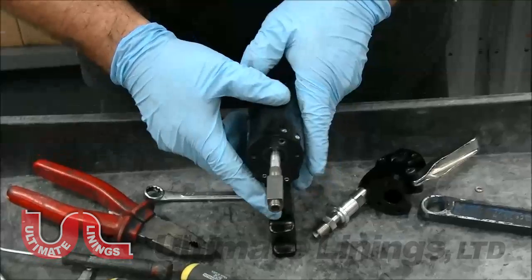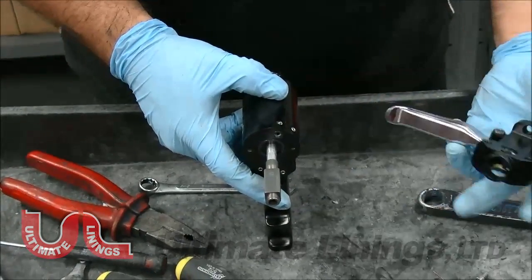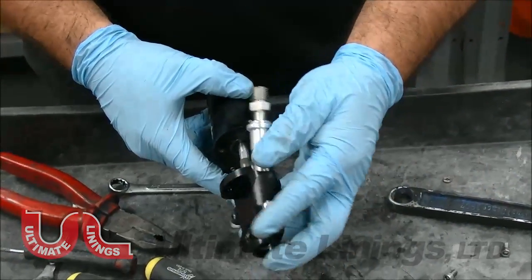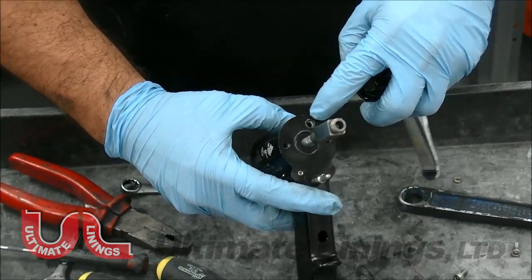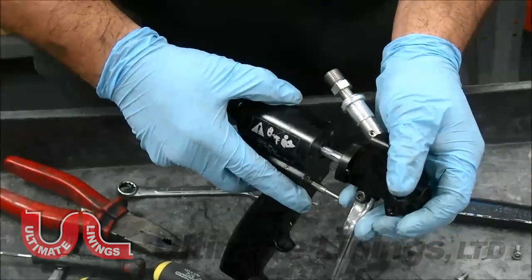The reason you want the O1 on top is so that this side is always the ISO and this side is always the poly — it stays the same, never changes. Now you're ready for the front housing. Before you slide it on, make sure those O-rings are in place, then slide the front housing on — it's a perfect fit and slides right on. Make sure you line up your ports.